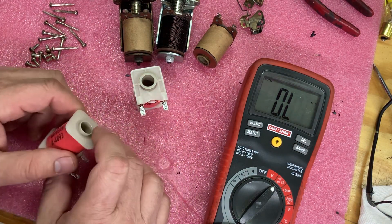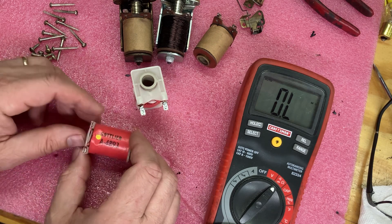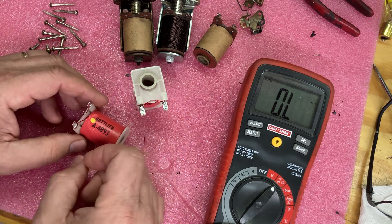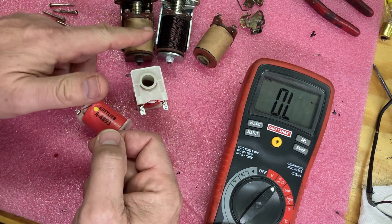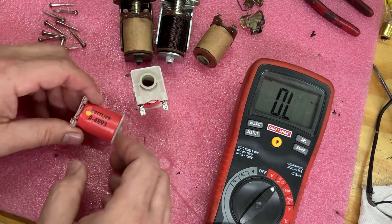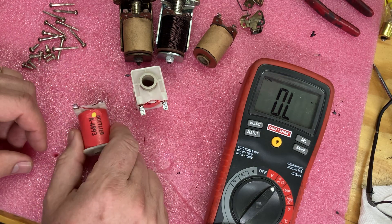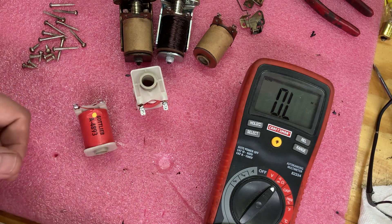I'm not sure — I mean, I could just go ask the internet, or call up Steve Young at Pinball Resource and he'd tell me immediately. I don't know if they're different because it's the same number of windings but just a heavier gauge wire, which would make the resistance lower, or if these have maybe a few fewer turns than the standard ones — that's also a possibility. But anyway, I just thought I'd show you the difference for what should be the same basic coil spec-wise or size-wise. There's definitely a difference in resistance, and it's got to be one of those two reasons, or maybe both — the wire gauge and the number of turns.